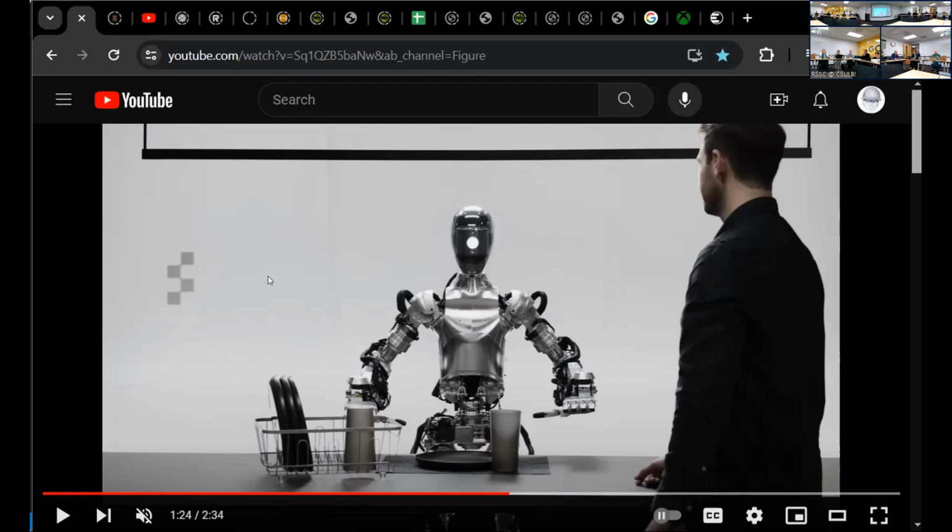That's why if you build something complicated with servos, when you turn them on, you have to give them a control pulse to tell them where to go. But if you don't know the initial position of the robot, you get the spazzy stuff, right?